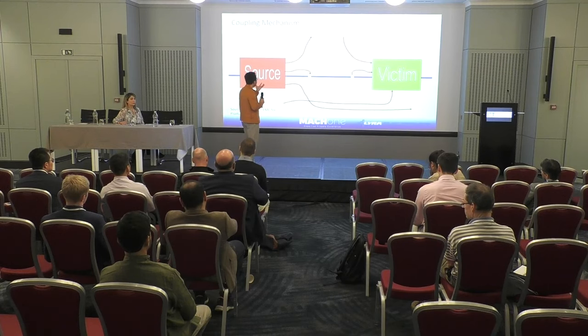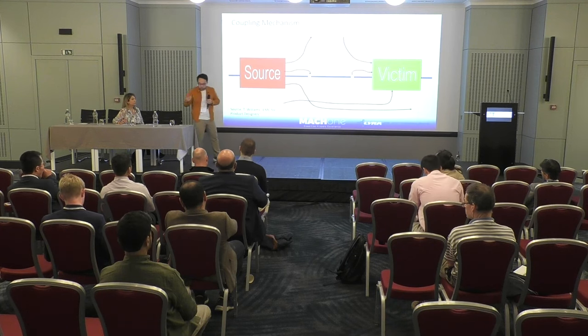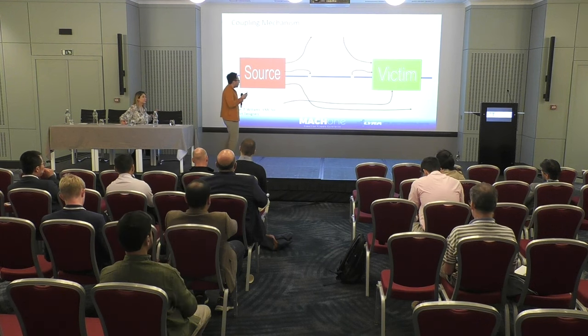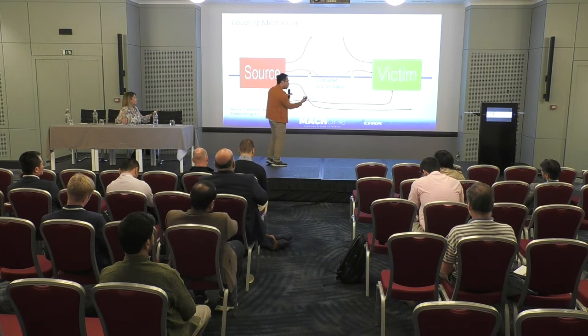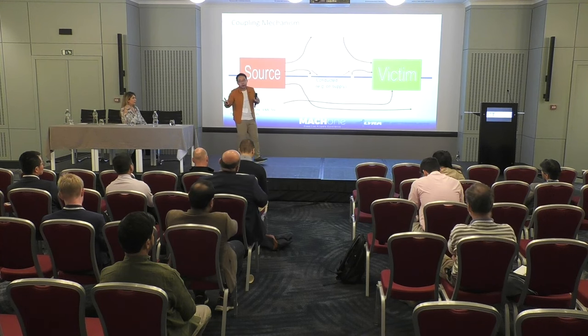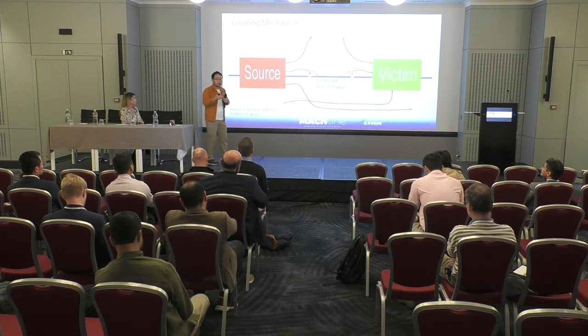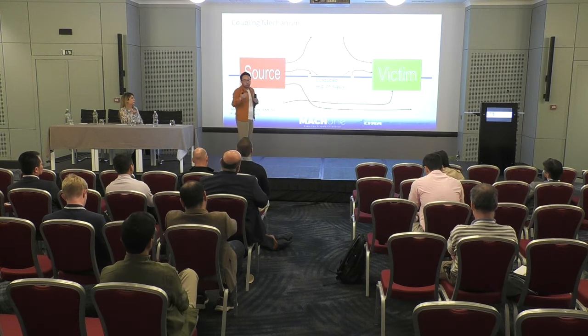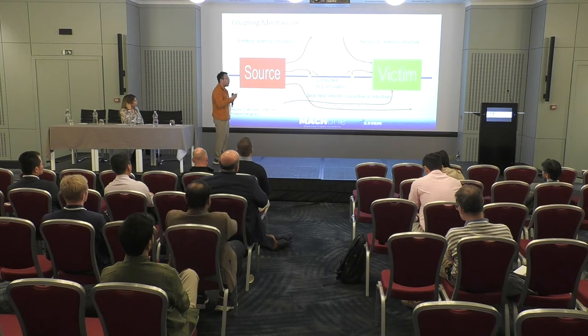The next subject I wanted to talk about, and it's particularly interesting for those who design power and motor drives, is coupling and parasitics. When we talk about coupling, there are generally four types. The first is conductive coupling, which is easy to understand. You just connect two pieces of equipment or devices using a wire. It could be power, Ethernet, USB, HDMI, anything. As long as the energy is using this wire connection to travel between the two, you have conducted coupling. The next one is what we call near-field coupling.